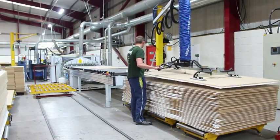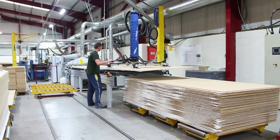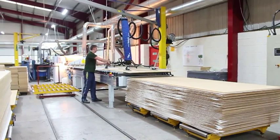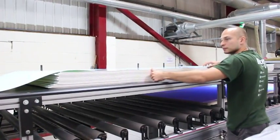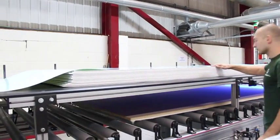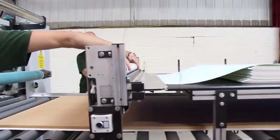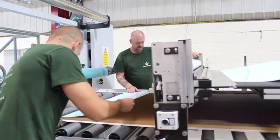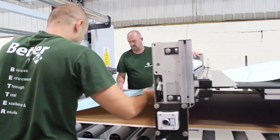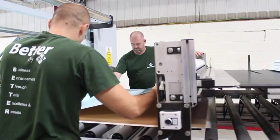The other type of door you can see in the store today is an acrylic face door. The first procedure for the E0 board when an acrylic face door is being produced is the addition of a foil on the board's reverse. The foil is added in a cold lamination process on this machine — one of the most modern and efficient in Europe today. The foil is applied using PUR glue, which has a very high heat and water resistance, making it ideal for bathroom and kitchen environments.